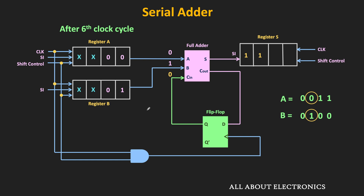While the serial addition is being performed, some new inputs will also be shifted into the register for the new calculation. After this entire serial addition, if the next calculation is not going to be performed, then this data could be some random bits, and it doesn't matter what is the input to the shift register — we represent them as X. Coming back to the serial addition, after the sixth clock pulse, A is equal to 0, B is equal to 1, and carry-in is equal to 0. So once again, the sum output of the full adder will be equal to 1, while the carry output will be equal to 0.